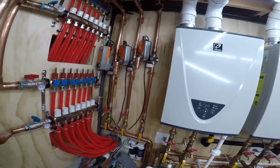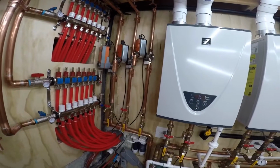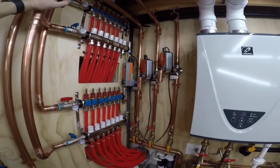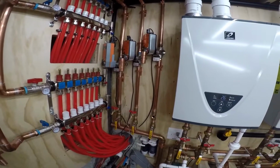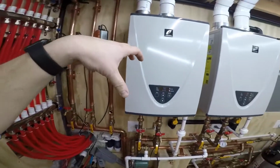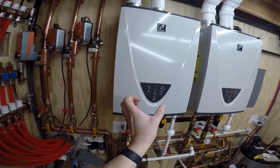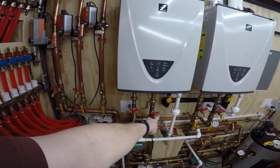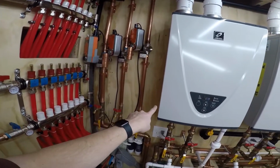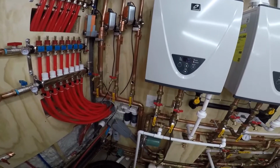But wiring will probably be the last thing I do, but it's always good to figure out, because I need to order this stuff. I need to order DIN rails, I need to order switches, and I saw online they make DIN rail blocks that you can have multiple wires coming in and going out. I can mount a power distribution block on a DIN rail and have the one hot coming in from the Radiant and then splitting to 2 to go out to each of these zones. Follow me? I'll have to draw all this up. But anyway, yeah, we're getting there.